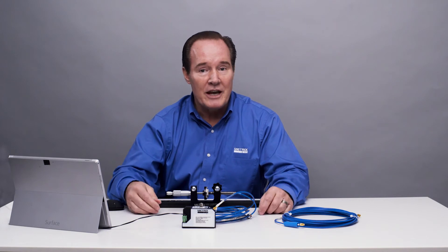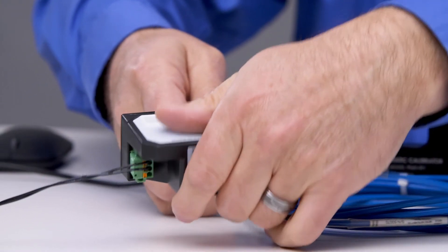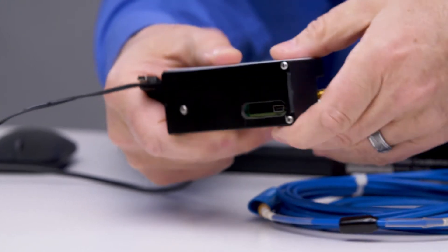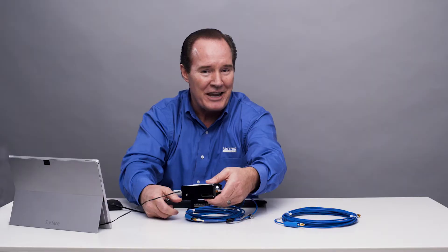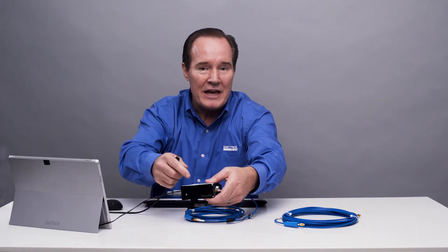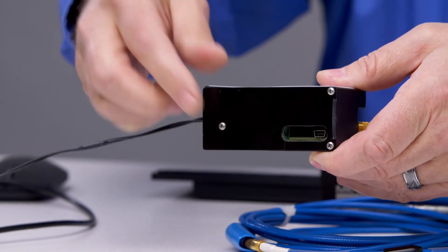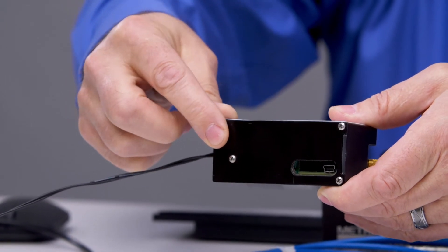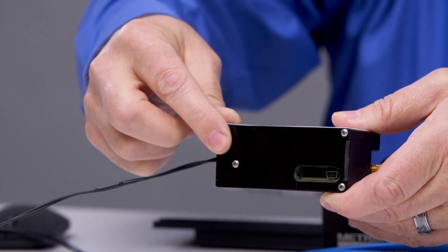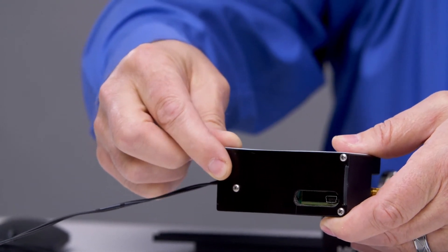That's our test for today. To start, I'm going to connect the DPS system to the computer using the USB connection on the bottom. This is usually covered by a DIN rail mounting inside your cabinet. So if you need to do this in the field, you remove that DIN rail mounting, remove the three screws, and then you can get access to that USB connection. We have a special plate on it right now, and we're connecting through that plate. In the field, you just take this off, connect, make your changes, and put the DIN rail mechanism back on.